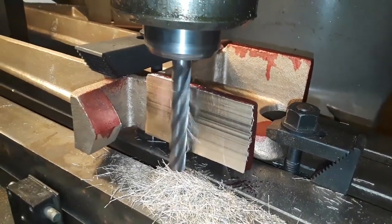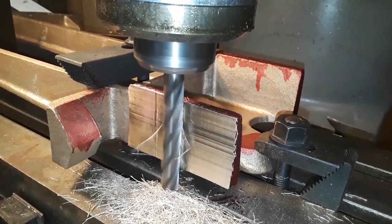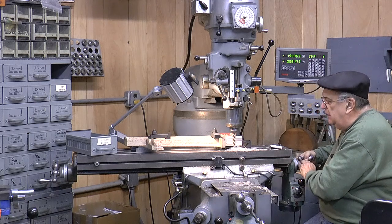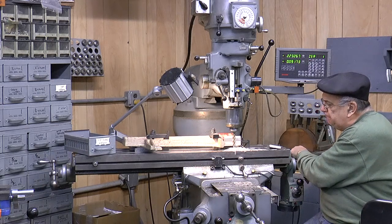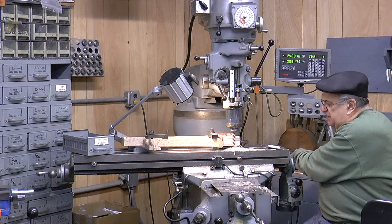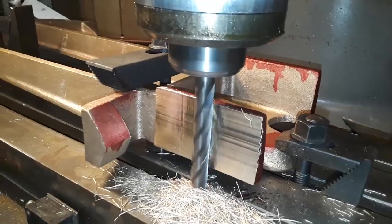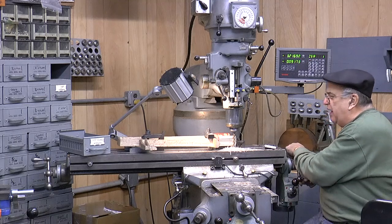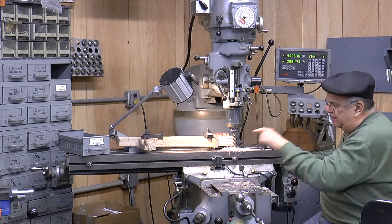There are a lot of little engines, locomotives out there — a lot of people still building them. Now, the railroad supply Mikado, or now it's Gonshaw — that's another controversy — we'll call it the railroad supply designed locomotive. It has a several-piece cradle, and the reason is it's easier to machine. However, I prefer a one-piece, which I may make a pattern for. I asked Peterson why he did that, and what he said was that in case they wanted to put a four-wheel trailing truck under it, they can make longer pieces in between.